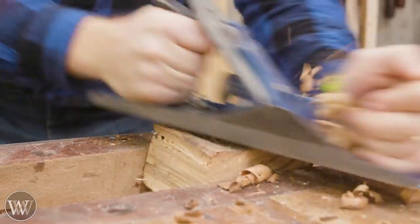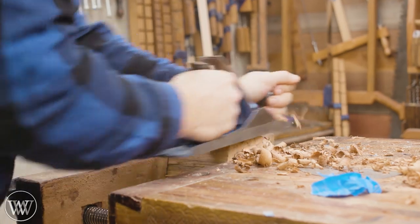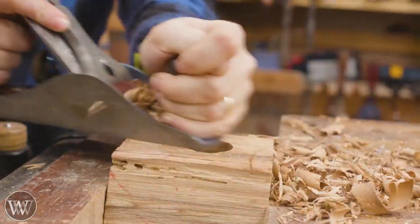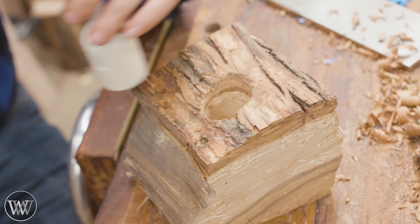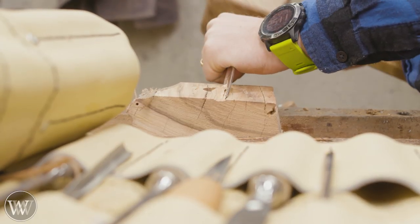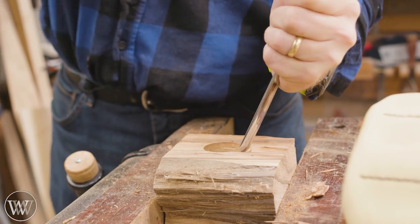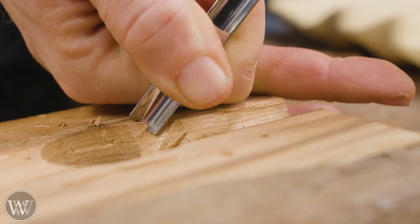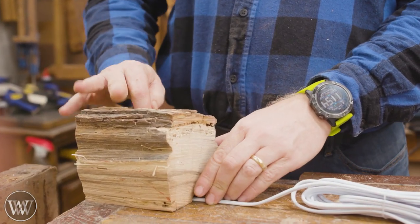There is our block. I wanted it to sit flat on the bench, so we grabbed the scrub plane and flattened off a spot. I didn't want the hole to be perfectly vertical — I wanted it to be slightly at a weird angle because this whole thing is kind of weird, so I wanted to have the whole thing weird. After scrubbing it flat, we can bring in a plane and bring it down really nice and flat. You can see how the socket I purchased will fit into that. Now I need a way for the cord to get out the bottom, so I grabbed a gouge and gouged out a slot for the cord to come out.